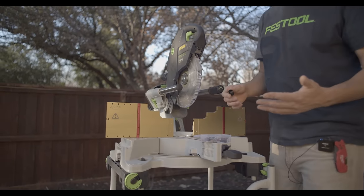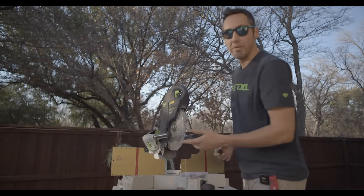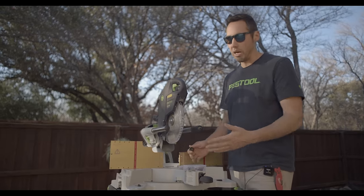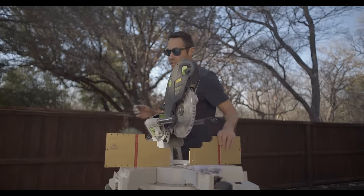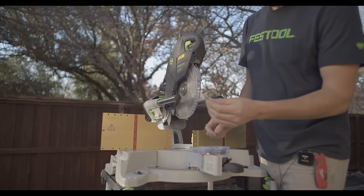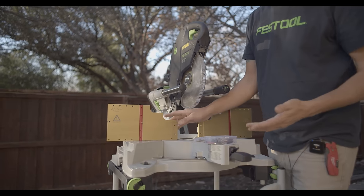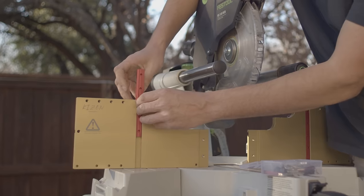With this system you get an accessory kit that includes two thumb screws for the backs of these T-tracks — there's a threaded hole right behind the T-track that keeps it in position. This is what I use for cutting crown and all types of projected moldings, offset panel moldings — pretty much anything. It takes your problem of cutting crown using the table of the saw and puts it up the fence, allowing you to still have your table free. It's on your actual fence — a huge improvement and one of the reasons I originally bought this. We also have five millimeter shelf pins; all the holes on this system are five millimeter.